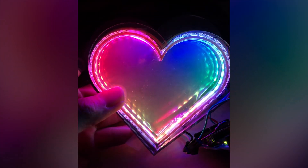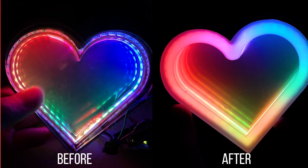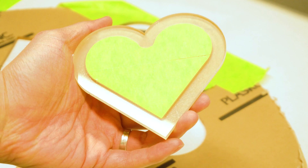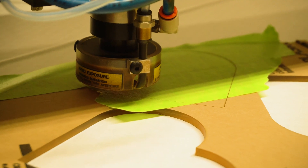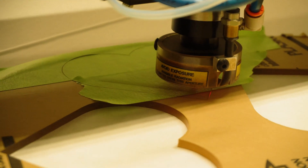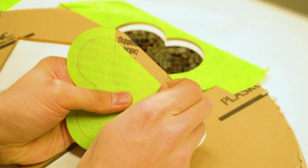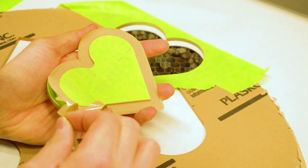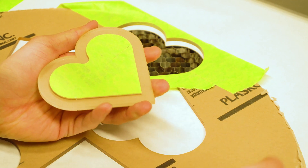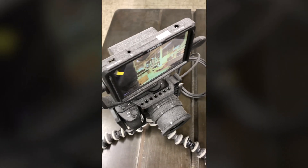The next is to cut all the pieces with laser. The first design of the inner wall had the LEDs making hot spots, even after I bead blasted them. So I ended up with a thicker design with blasting to blend the LEDs better. Another thing I tried is to use the film on the acrylic sheet as a mask, made with really low laser power just enough to cut the film, so you can peel it off for processes like spray painting or bead blasting. I added extra masking tape before the cut to make the mask survive the blasting better. The peeling is really satisfying. I also learned it's probably a bad idea putting your camera inside a bead blasting chamber, so don't do it at home.